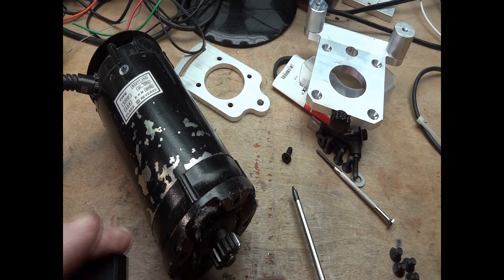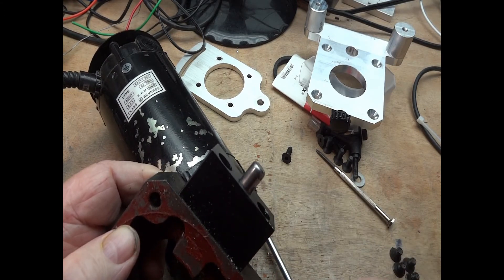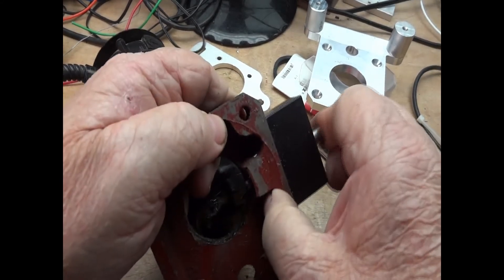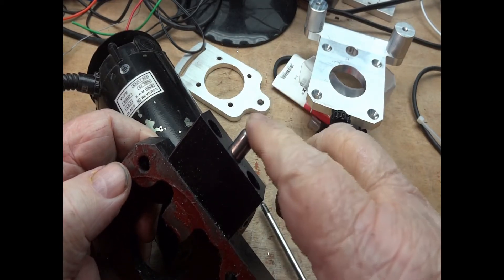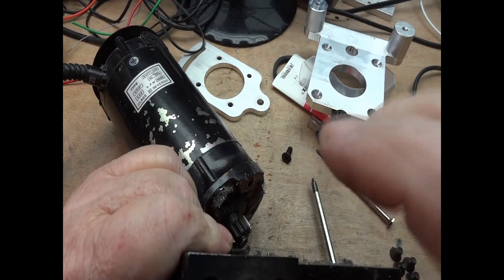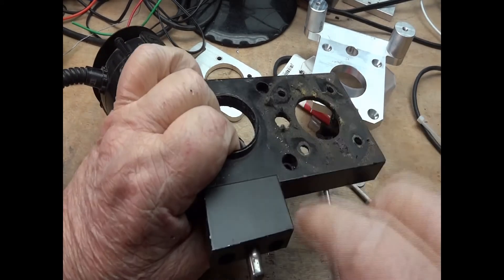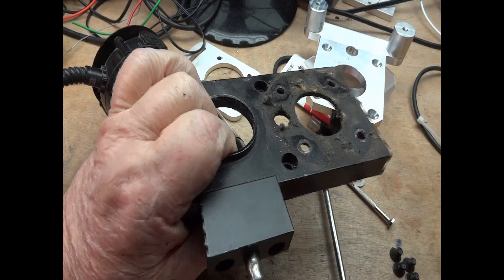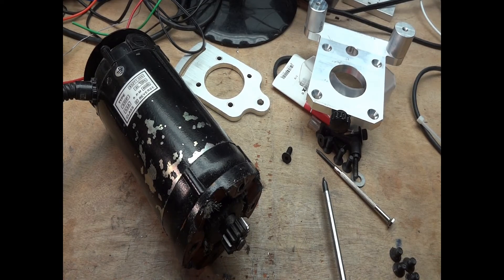12 years' worth. But this is another thing I'm upset about — this kit is not thick enough to use my spindle lock. But the one designed by Mr. Kemp is; in fact, he has one on the front of it. This is the spindle lock — spring loaded, it's nice. I'd prefer to make a different block with a little bigger knob and a plunger and a roll pin, and a groove with an L-shape to it, so you could push it in and lock it when you need both your hands for tooling. This would have a roll pin that would lean over and lock, so I might revise this thing in the future.